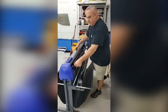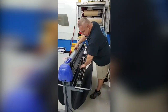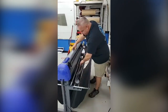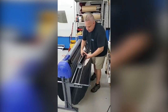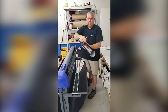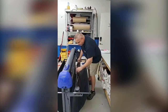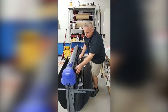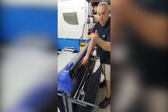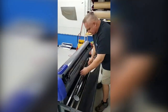To disengage these pinch rollers, I've got to use this lever, which lifts it up at the same time, and then the film just falls right out. I also want to point out that this roll here — the release liner is facing me. So if I put the film down on the roller bar, I've got to feed from the bottom into the machine because I want the film facing up and the release liner facing down.